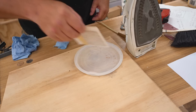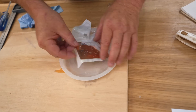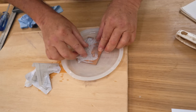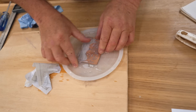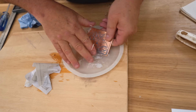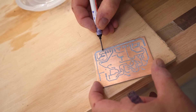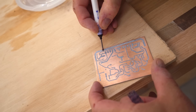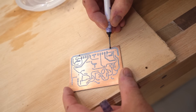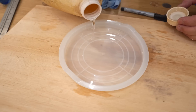From there, I take it and put it in water, let it soak, and that'll make the paper come off easier. You want to rub all that off with your thumbs, and you can be pretty aggressive here, even using a Scotch-Brite pad if you need to. Now there might be one or two places where the toner didn't stick, and you can fix those with a Sharpie marker. Unfortunately, that's not what I'm using here, so it just dissolved when I etched the board. But I do know that a genuine Sharpie does work. If you have a lot of things that need to be fixed, you're better off just starting again — just make sure the board is really clean this time.